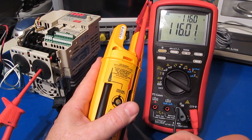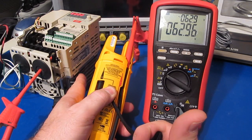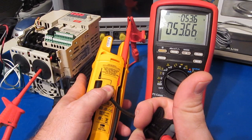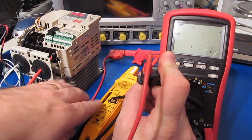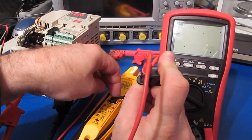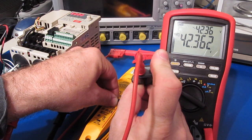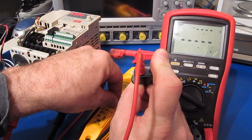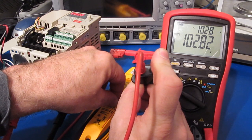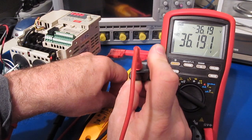There you can see we have about 115 volts. If I place my finger on that to ground, you can see it dropping down pretty quick. What I'll do is hold the lead on there with one hand, and then short this thing out with my other hand — and there you go, about 41 volts. If I take my finger off, see it flies right up to 100. Retouching the heat sink, there's about 35 to 36 volts.